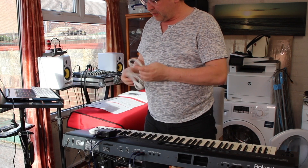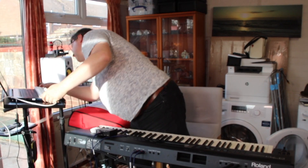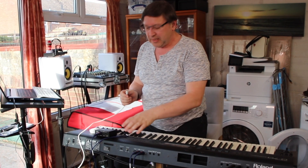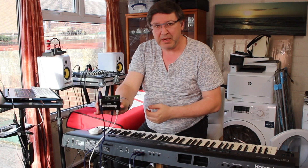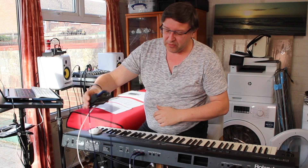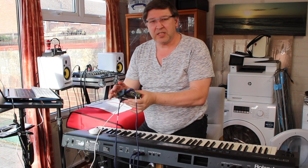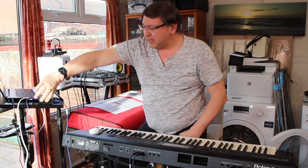Next I'm going to plug the USB interface into the computer. I'll take this cable and plug it into the USB interface on the far side of my computer, then into the MIDI interface. You can see the lights have now started to glow — this interface takes power from the USB bus. The computer has registered the interface, I can switch the keyboard on and it powers up. I'm now ready to record from the keyboard or receive data from the computer.